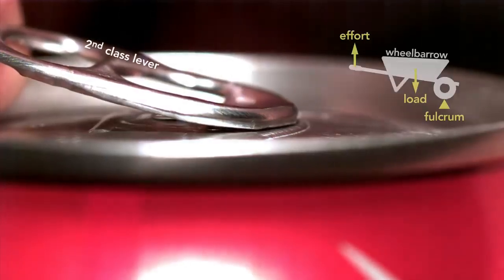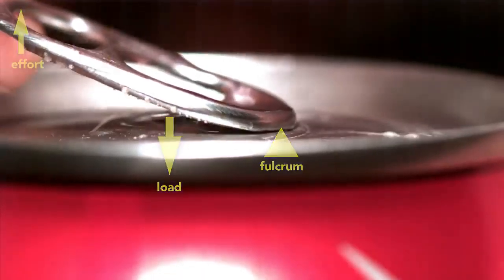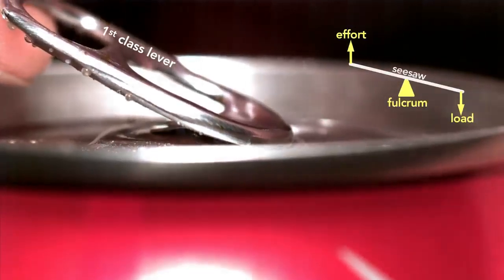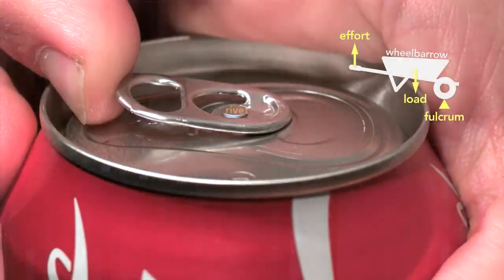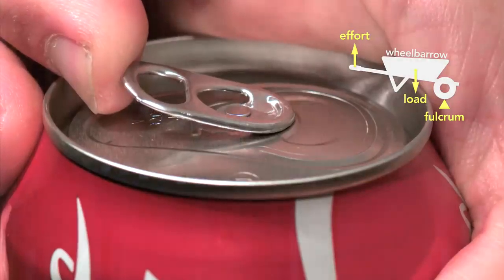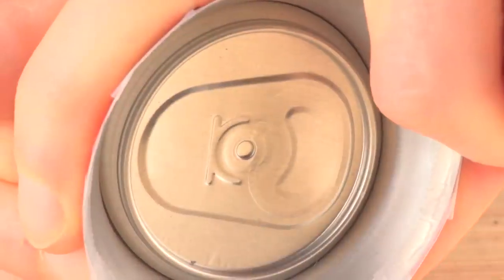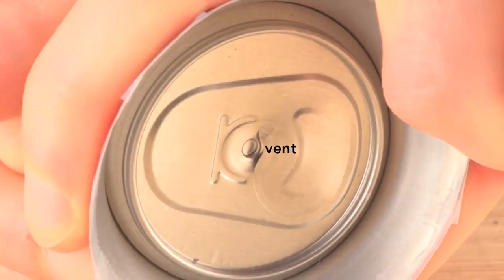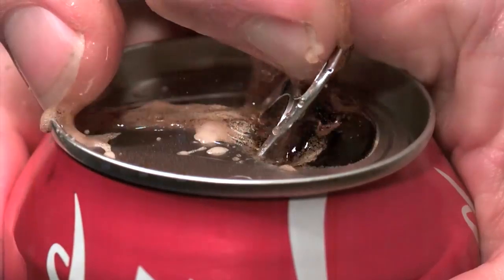This little tab involved clever engineering. The tab starts as a second-class lever — like a wheelbarrow — because the tip of the tab is the fulcrum and the rivet is the load, with the effort applied on the end. But here's the genius part: the moment the can vents, the tab switches to a first-class lever, which is like a seesaw, where the load is now at the tip and the fulcrum is the rivet. Part of the reason this clever design works is because the pressure inside the can helps force the rivet up, which in turn depresses the outer edge of the top until it vents the can, and then the tab changes to a seesaw lever. Looking from the inside of the can, you can see how the tab first opens near the rivet. If you tried to simply force the scored metal section into the can using the tab as a first-class lever with the rivet as the fulcrum throughout, you'd be fighting the pressure inside the can — the tab would need to be enormous and expensive.